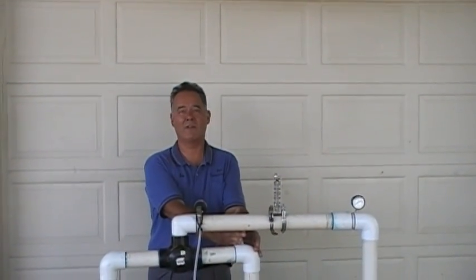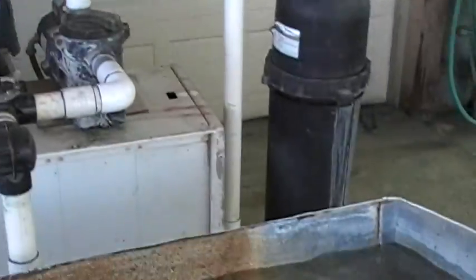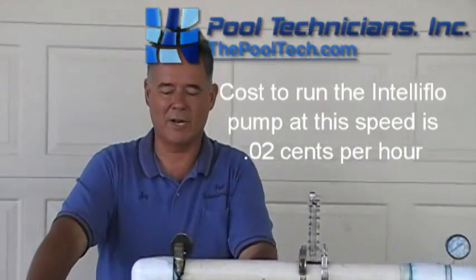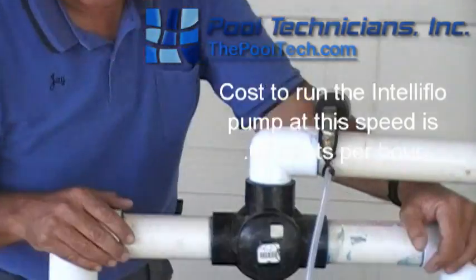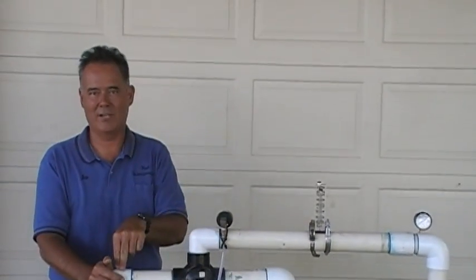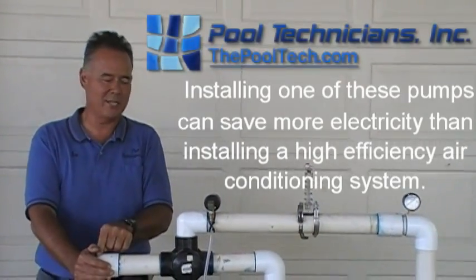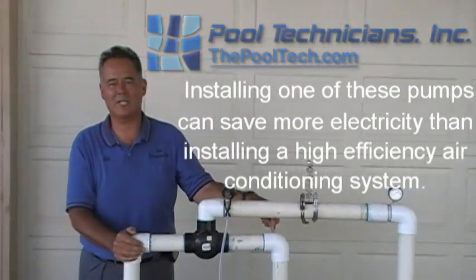This is where getting a 50 to 70% savings is very doable and very easy with these pumps, just by cutting the speed down and running more hours. We cut down to one last lower speed — about 20 gallons per minute right now. At 20 gallons per minute, the pump gets so quiet and so efficient that it hardly makes any noise at all. On our meter: 0.07 — that's 70 watts. We went from 2,000 watts to 70 watts. We can run this pump pumping 20 gallons a minute 24 hours a day — 24 hours nonstop for about the same money it costs to run the old pump for one hour. This is where the big savings on these pumps come in.